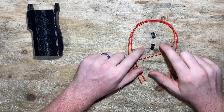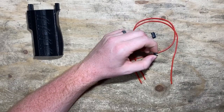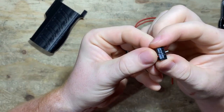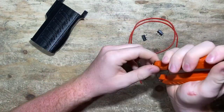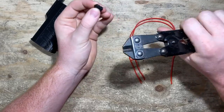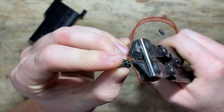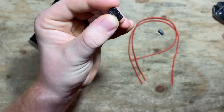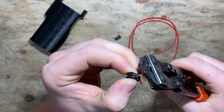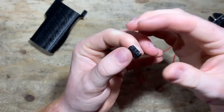First, we are going to get these little switches wired up. They're pretty small and they're going to fit into a pretty small space. You can see where the four holes are — there are two holes on each switch. It's going to be pretty compact and tight in there, and the wires won't have a ton of room. So something I like to do is use snippers to snip each of these prongs to about half their current length, to provide more room for the wires in the channel behind the switches.